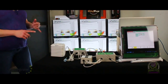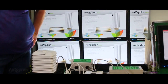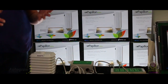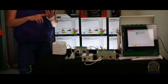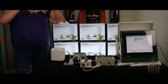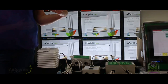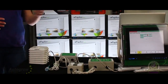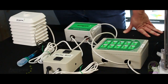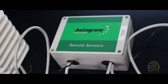This unit can run up to eight remote sensor boxes. There's no real max on how many output modules it can do — the software can run eight reservoirs. We recommend no more than eight parts per reservoir: nutrients, additives, and pH — typically an A and a B and a pH down, plus five additives. It can run eight peristaltic pumps for eight different reservoirs, so a total of 64 pumps — for example, veg, a couple of blooms, with different feed schedules for each one. These components daisy chain together; with up to a mile of Cat5, that gives you a lot of room in a big warehouse. If you realize a room needs a second environment sensor, all you have to do is cut the Cat5, wire in a new one, and tell the unit you have one more — you don't have to take everything down or rewire everything.